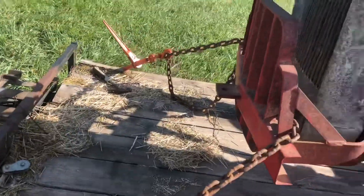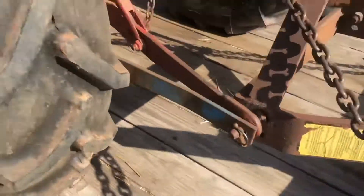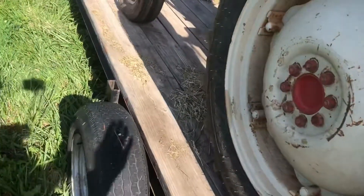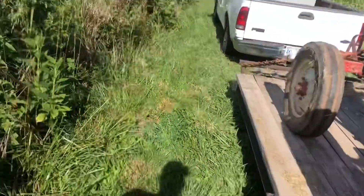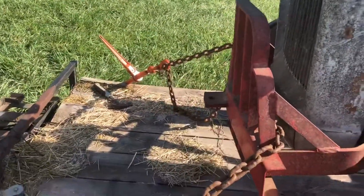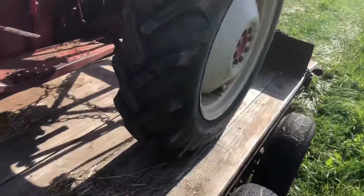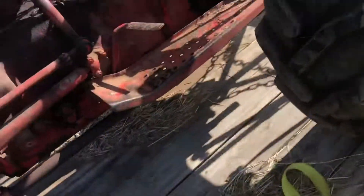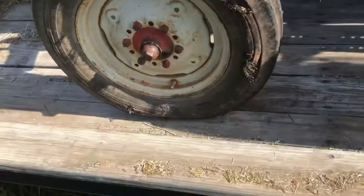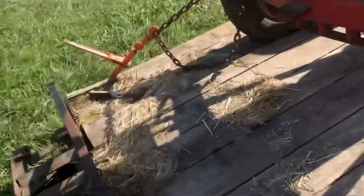Let's get her strapped down. I put the chain on the back, put it in neutral, let it roll forward and put tension on the back chain. While it's still in neutral, I've got the blade down so it don't fall forward. Then I put the chain bind on the front, pull it forward, which tightens up that chain. Then I've got a big strap hook across the middle as an extra. I'm going to finish strapping it down.